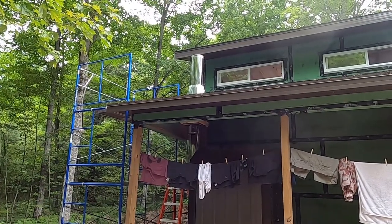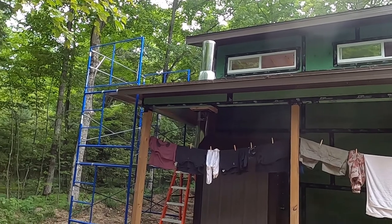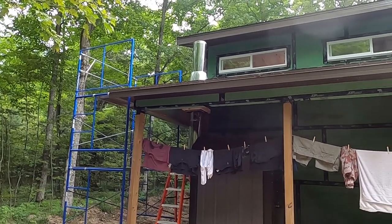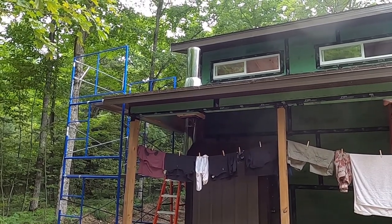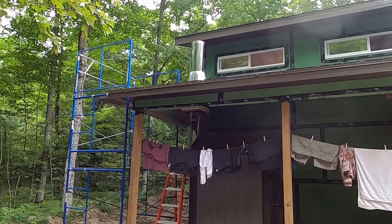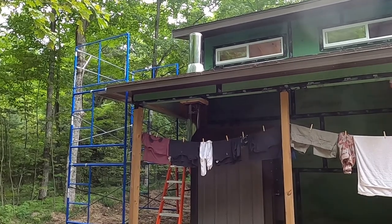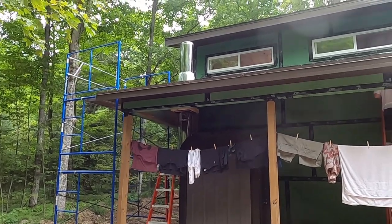What I'm going to do is go up there, blow off the roof again, mark off the location for the flashing, polyurethane the ever-living heck out of it, take some roofing nails, tack it in place, and then polyurethane the edge on the top side as well. With all that done, we'll let the polyurethane dry, remove that chimney section, and do the full roof over the top of the flashing.